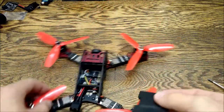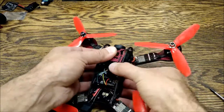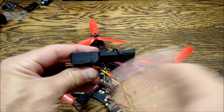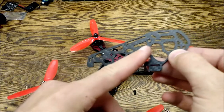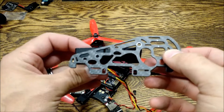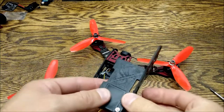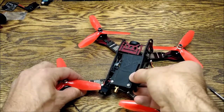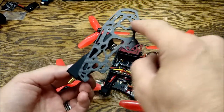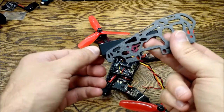Let's get this into the frame. You see these tabs that I have that stick out — those match up to this and to this right here. So when you put it on, it snaps right in there, just like so. And when you put the screws in through the standoffs here, here, and here, it will squeeze onto this side and hold it.